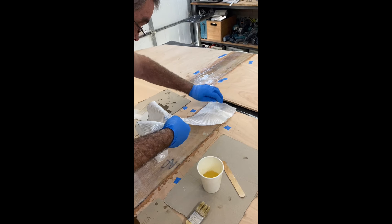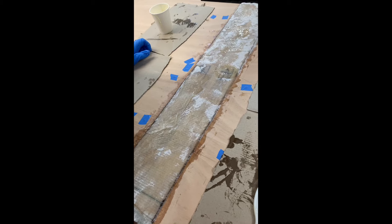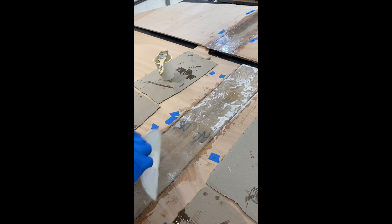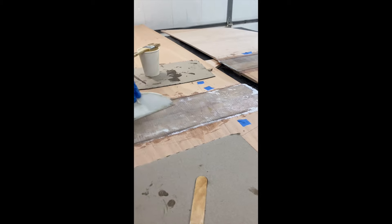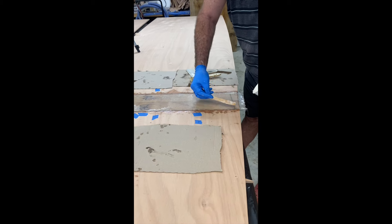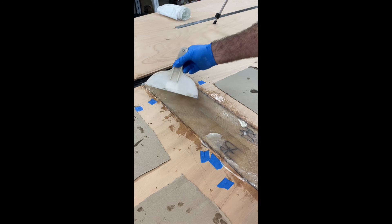The little bits of blue tape that you see cover the screw heads from getting jammed up with epoxy. Those screws are actually holding splints of scrap on the inside just to keep everything squared up and straight. This 200mm wide plastic drywalling knife or scraper is ideal for this job as it covers the full width of the joint. We thickened up some epoxy with a bit of 404 and worked that carefully into any gaps that may have popped up between the edge of the plywood and the margins of the fibreglass — it's important that we've got an absolutely solid joint.